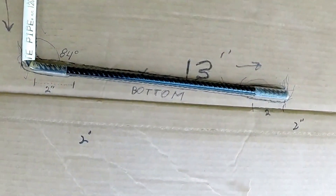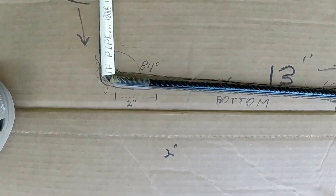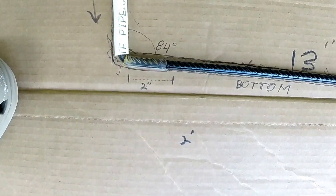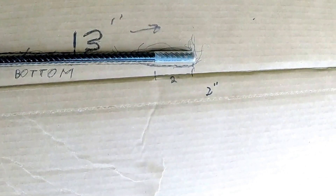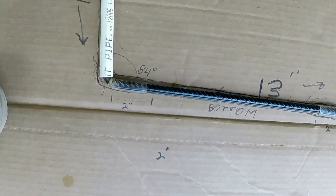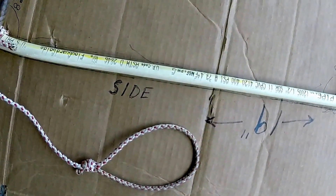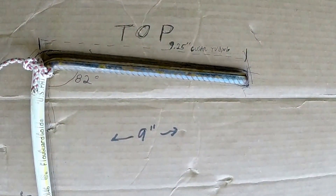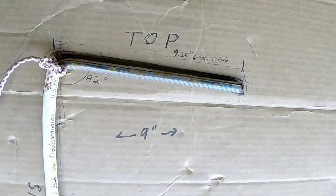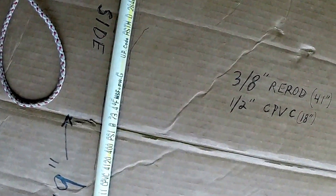The bottom is 13 inches long and the corner is bent to 84 degrees. There is a small piece of clear vinyl tubing — two inches in the corner and two inches on the end — to protect the boat from being damaged. This is a half inch CPVC pipe, just to protect the boat from being damaged. The top has a nine and a quarter inch piece of clear tubing on it, and that's the part you hold in your hand. There is a lanyard here to keep you from losing it over the side, because since it is all metal it would not float very well.